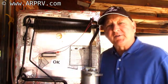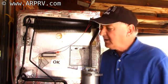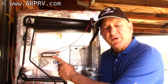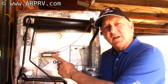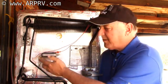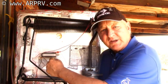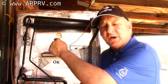Let's talk about the difference between a fan and a blower and the advantages of one over the other. Fans are very inexpensive, especially these computer fans. In this position, the fan brings air in the bottom and blows it out the top. But air takes the path of least resistance, so it ends up sucking the same air back in that it blows out the top.